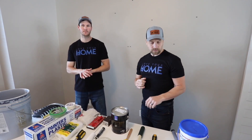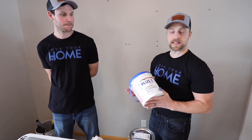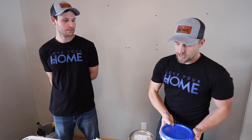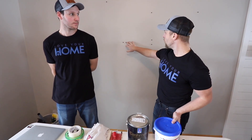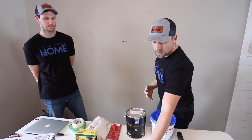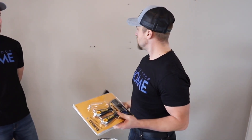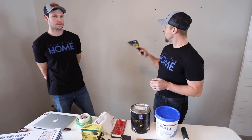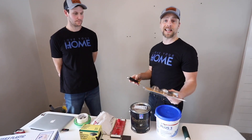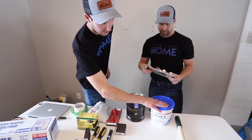For your paint project you're gonna need a tub of Plus Three, which you can get at Lowe's or Sherwin-Williams — it'll be in the description and website link. You're gonna use this for any nail holes or screw holes in the wall. Take the spackle, take the knife, fill them in, and pull it tight to the wall instead of leaving a big goober on there, because those are hard to sand and hard to get rid of.